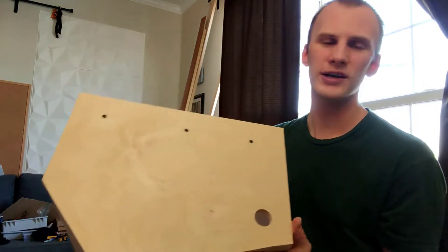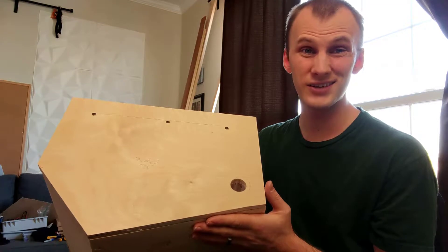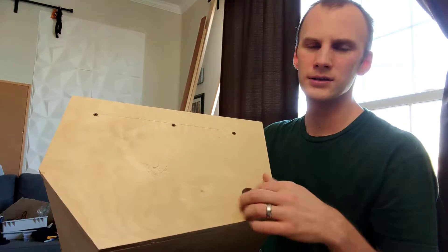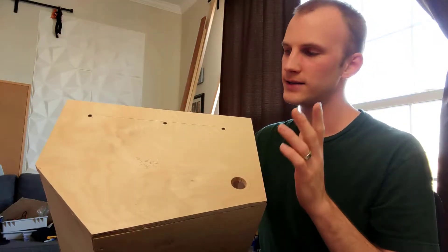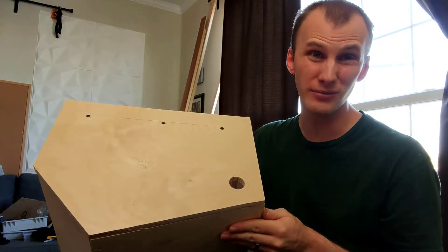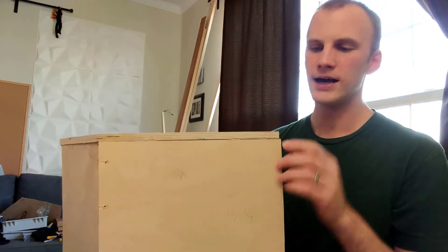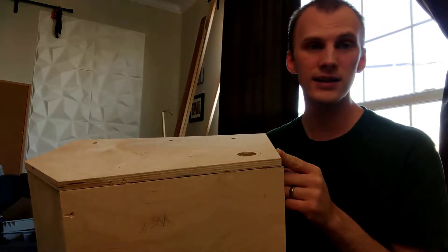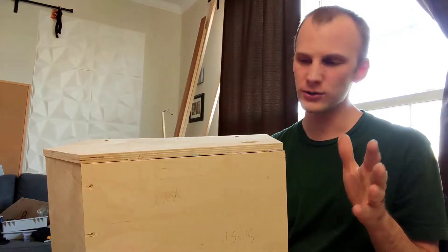What I did was first cut the polygons. I cut everything with my circular saw. If you have a table saw that can tilt the blade, that's a much better choice. I cut my sides, did two of those, tried to make them as close as possible — they're not perfect. Then I cut all the pieces except the front piece, the baffle, where the speaker mounts. I measured the angles and tried to cut them well with my circular saw, and it worked okay.